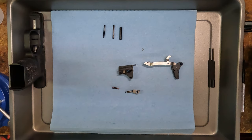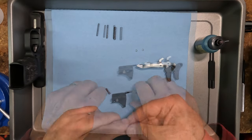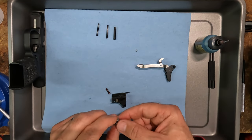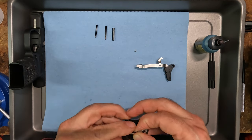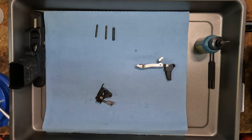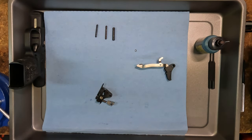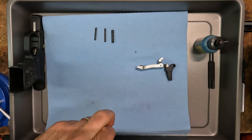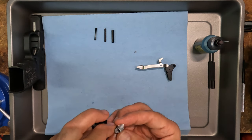All right, let's get the sear housing back together. First, get the pin in — just give this thing a little drop, roll that in a little bit. The sear is going to go forward so the pin's in the back; I want to roll it up when I get there. I'll run it through the spring. I like to dab just a little bit of white lithium on the sear.